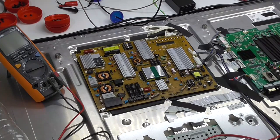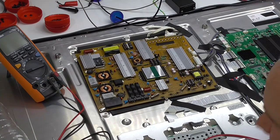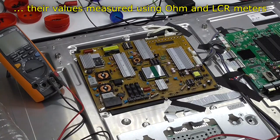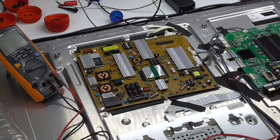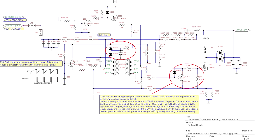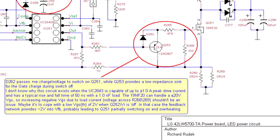The second part of the problem is that in tracing the circuit out, I've been using the component labels, and they're not particularly readable. So with a combination of interpreting the writing on the components and measuring in circuit, I'm still confused as to how the circuit configuration gets it up to 59.2, assuming there's no fault, in terms of the voltage feedback resistance and the rest of it. I'll insert a bitmap of the circuit as I've done it so far. I've noted on the circuit diagram some oddities I've come across and things I've recognised.